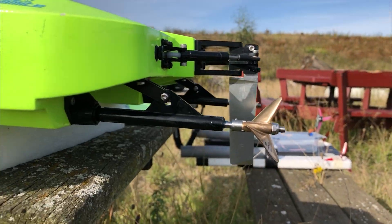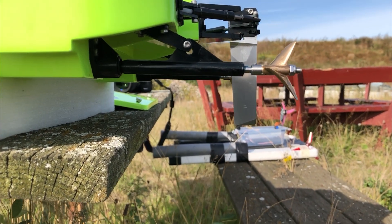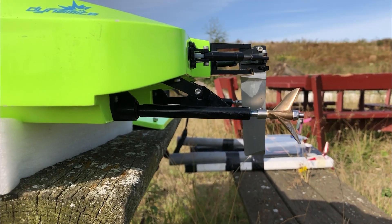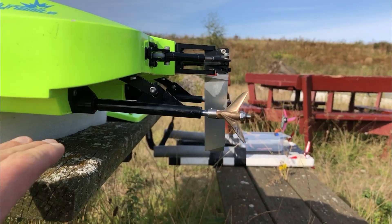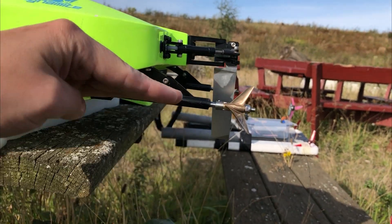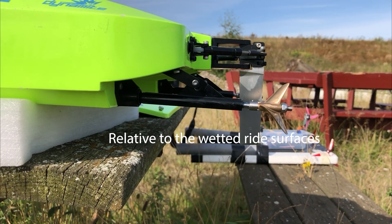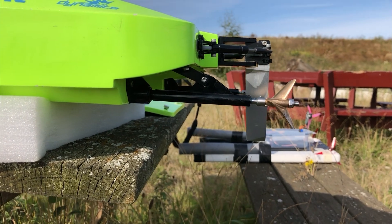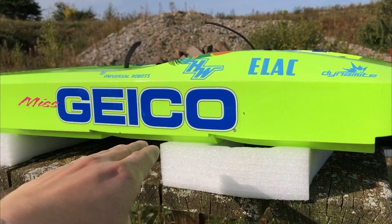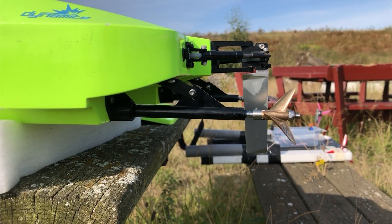The angle of the drives is very important. As you can see here — it might be a bit hard to see — but the angle is basically measured from your planing surfaces. The angle you have compared to the planing surfaces is either up or down. A completely level strut angle would be parallel to the planing surfaces of the boat.